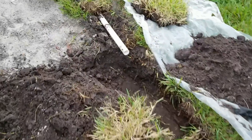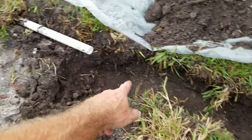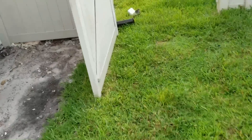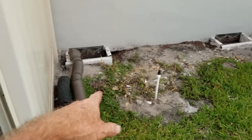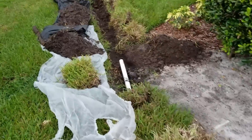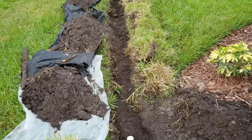We're going to hook up — there's a pipe here from the sump pump — and we're going to bring that into the four-inch line and let it be carried away. This line's going to turn and come over here, and we'll attach this downspout drain. There'll be a T here, and we're going to pick up the downspout drain in the back. That line's just going to come right through that bed and come straight down and tie in. A really simple project — I know it looks involved, but I've been here 20 minutes and I've already dug this entire section of the trench. It goes really quick.